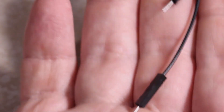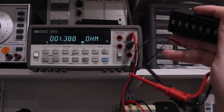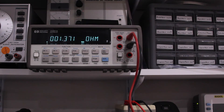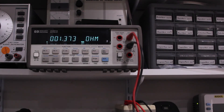Let's take a look at how it performs. I have a couple of jumper leads — when I put it in a project box I'll use banana terminals or something more robust. I've got it wired up to my multimeter with some test clips. As you can see, we have about 1.4 ohms of resistance when the decade box is set to zero, which is higher than you'd want for a professional device, but pretty reasonable for what we're doing here.